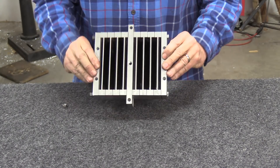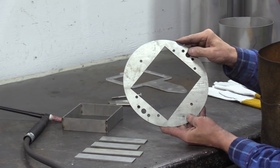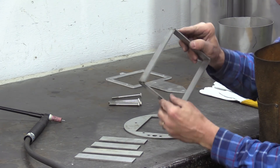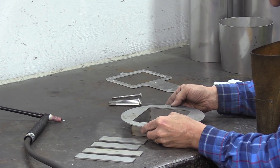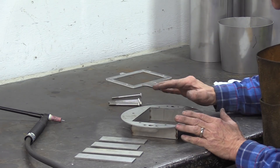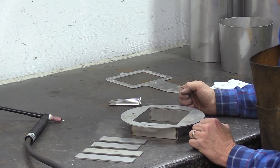That's all there is to it. Now we're going to weld the bulkhead together. We have this eighth-inch thick material that already has all the holes in it for our injectors and stuff. Then we're going to weld together this little box out of these four pieces. I'm going to take this box, set it down, set the bulkhead over it, and go in with my torch and fuse weld from the inside all the way around there — because the material is so thick you don't even need to use any rod. After that's done, we'll drop our bolts in here and weld them in, flip it over, and then we can weld that on the combustion chamber.